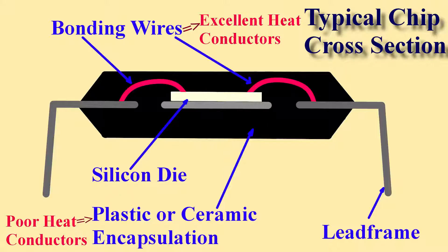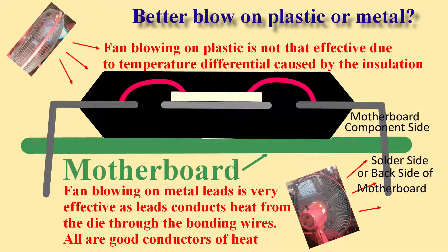If you examine the metallic part of the chip construction, it consists of the leads. So a good alternative is to try to cool the die through the leads. In this example, we can observe that a fan blowing onto the top of the package will not be that effective, as it will be cooling the package directly and only indirectly cooling the die. Whereas if we blow the fan at the leads of the chip, we will be directly cooling the die inside — quickly.